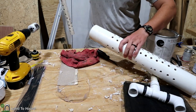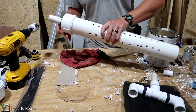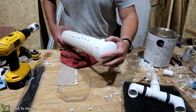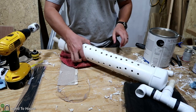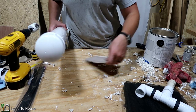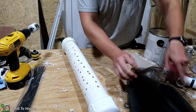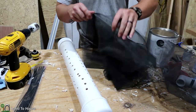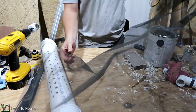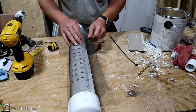To get this assembled I'm just going to stick this pipe into here and that will cinch down like that. The other side will keep out debris coming down the creek. So the next thing I need to do is get the screen on here so that all this silt and sediment won't be clogging it up. I've just got a piece of regular window screen that I want to cut down to this size here. I've got some 14 inch long zip ties to get this screen to stay on.